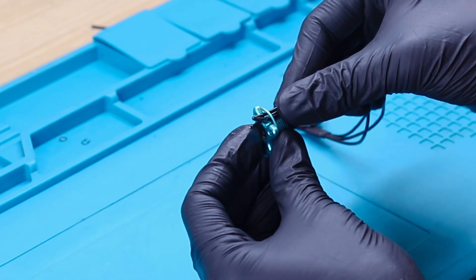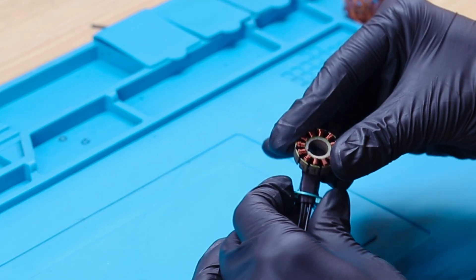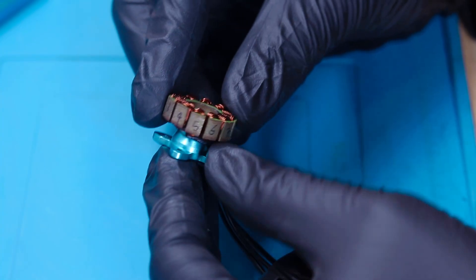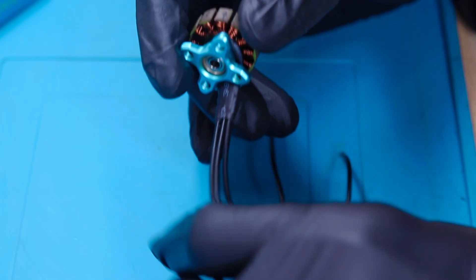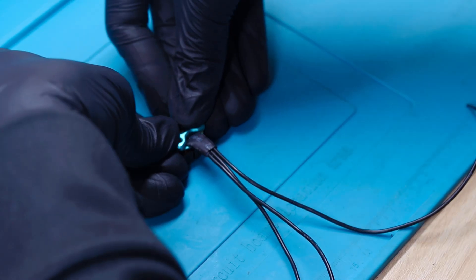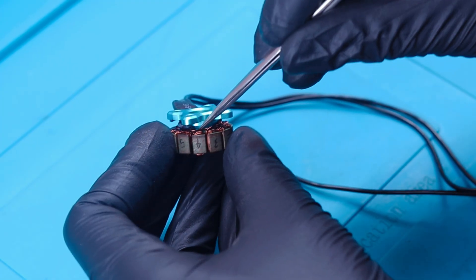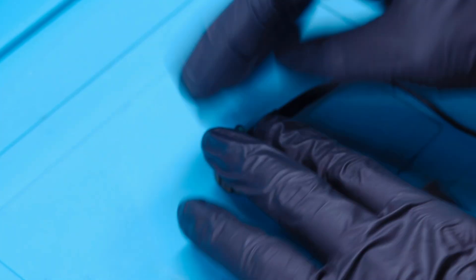Make sure you insert the wires first, then put the stator back. Now it is time to put the stator back to the base. Once the stator is aligned and inserted, make sure you apply some pressure and push it all the way to the bottom. Once that is completed, you can apply a little bit of epoxy or other glue so the stator will not come off, or you can hammer it down to the base of the motor without damaging it.